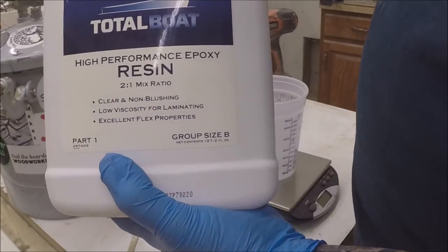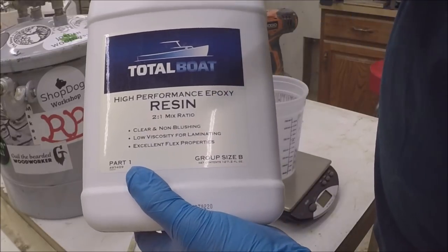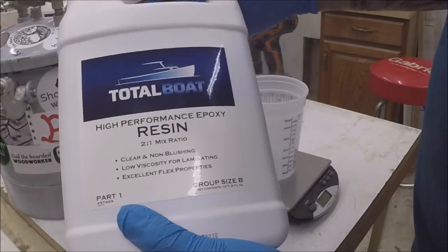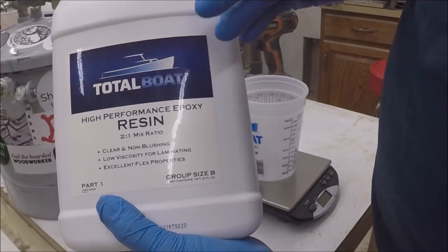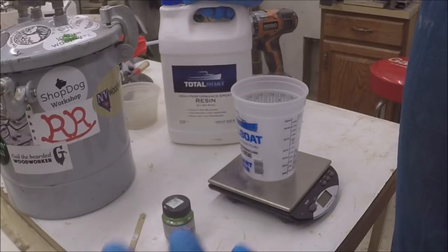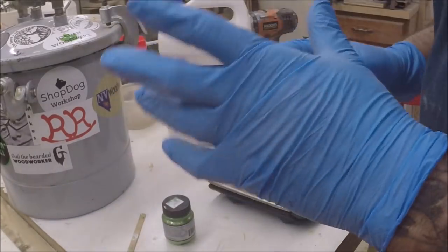The issue with the rubber was probably because it's a little cold in the shop. It's only 70 degrees in here. And, you know, it is what it is. But so 2-to-1 on this. This is going to get 45 grams of hardener, the 2-to-1 slow set hardener, per 100 grams of this. So I'm probably going to do two pours, 400, 500 grams of this, and then whatever that 45 times 400 or 500 is. I think it's 225 if I go five or something. I don't remember. I'll figure it out in the calculator. But the numbers aren't exactly 2-to-1.